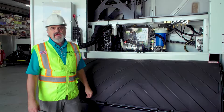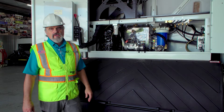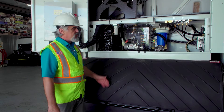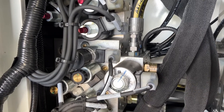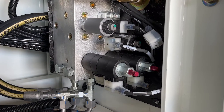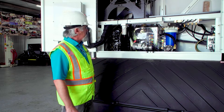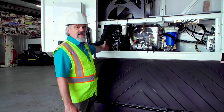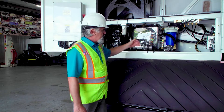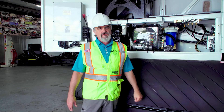The hydraulic system for the M6 Avalanche is located on the back of the truck body. The hydraulic system consists of the left manifold and the right manifold, which are actually two separate manifolds together. When the hydraulic pump is engaged, pressure comes out to the left side manifold, and as needed the right side manifold gets pressure from the left to operate the functions on the right.